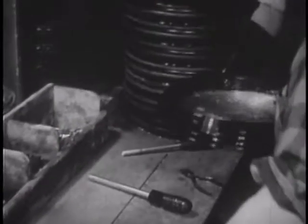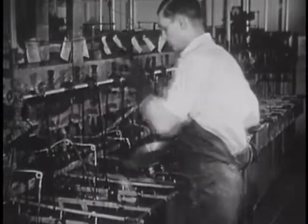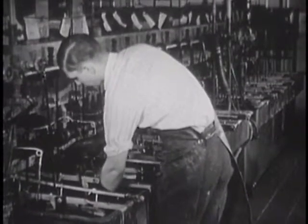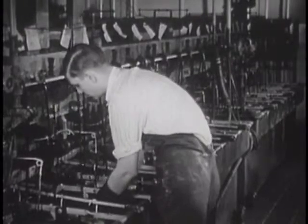After another washing and film coating, it goes into another copper bath where the stamping matrix starts to build up. The double disc bubbles in its bath until the tiny electrified particles of copper grow into a hard, strong coating and the plating is finished.